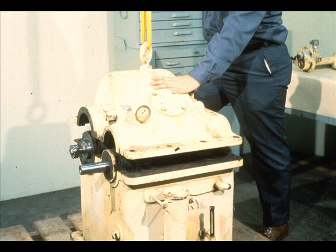Now, with a sling fashioned in the eye bolt, apply tension slowly with the hoist until the joint between the cover and the gear case is broken. As you know, on large units, jack bolts are usually provided to assist in this task.